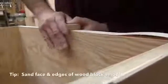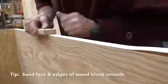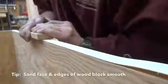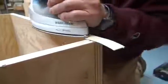Then you take your roller or your wood block and you really roll and press it in. You want to really make sure you get good adhesion to the edge of this plywood. You're going to do that all the way down, keeping that edge flush as you go, heating in 6 inch sections and rolling or smoothing with your block. When you get to the end, finish it, and then you can trim your ends, and then you can trim your edge.